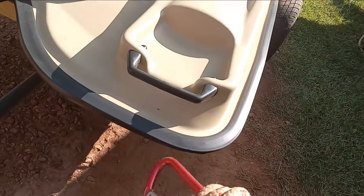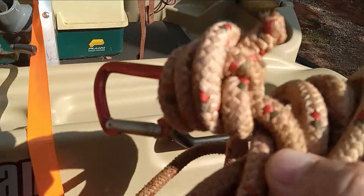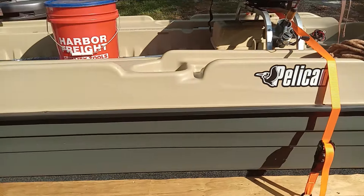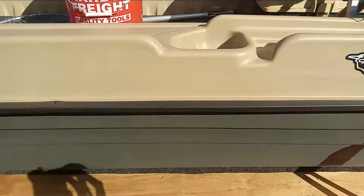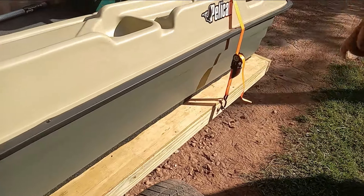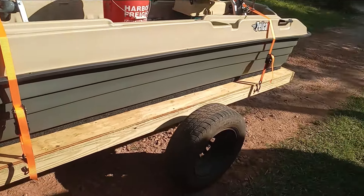I've got a dock line that I can hook to the boat. When I'm unloading, to keep from getting my feet wet, I latch one end here, lay it along the edge of the boat, and latch the other end to the locking point. Then I back the trailer into the water, the boat floats off until it reaches the end of the line, and the line is long enough that I can pull the trailer out, walk down, grab the rope, pull my boat up and tie it off while I go park the trailer.